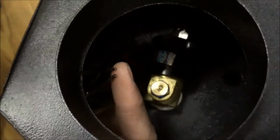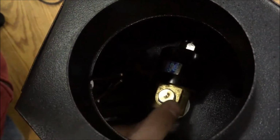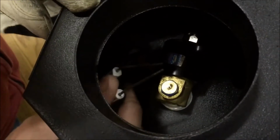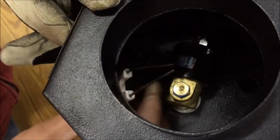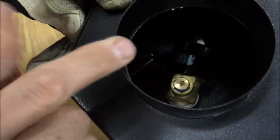And you see these two wires here. This is the igniter. And then this hole here is where the fuel comes out. We do not want these wires like this over the fuel. You might think you do, but actually the fuel is going to blow out the spark. So we want it offset about as much as we can get without touching the side of the machine.